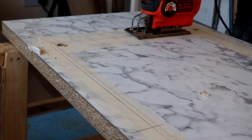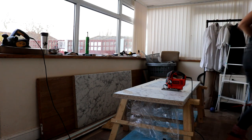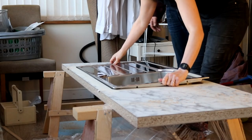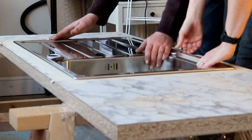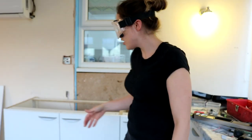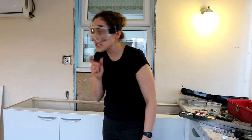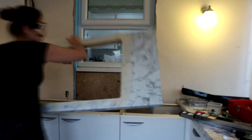What I didn't get on film is that as I got closer to cutting the hole out, I got my fiancee to support it so it didn't fall and take off any of the good laminate. The proof is in the pudding — it fit perfectly, like a glove. Now I've got to place the worktop on top and see if I need to trim any of the frame for the sink, which I think I'll have to do a little, but it'll be lighter to pick up now with the big hole in the middle.